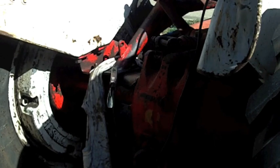I had to pressurize the system. I cleaned it up. I couldn't get it to leak out of the crack, so I had to put air in the system. These tires are full of water. I just chopped them off, and you can see how much I had to leak out of this side. That was down to like 6 pounds. They're supposed to run at 14. I put them at 20. That one looked low. Yeah. That one's at like 3.